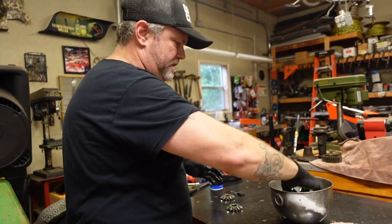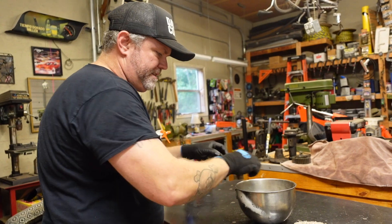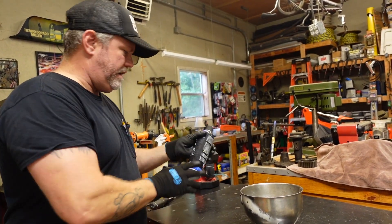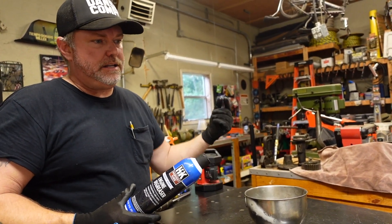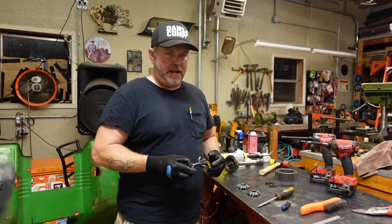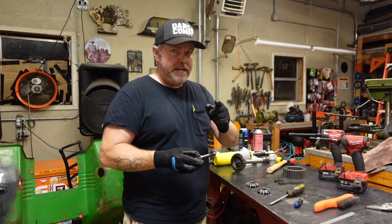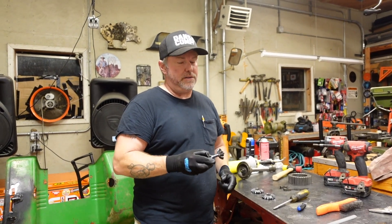We're going to put all the pieces we need to weld in this stainless steel dish. It has to be perfectly clean, so we're going to use some degreaser first, then wash it with hot soapy water, then take brake cleaner and acetone to it. It's a couple of hours later, but we got all this stuff prepped and clean. Clean is the most important thing — it's amazing how nicely something welds when it's very clean.